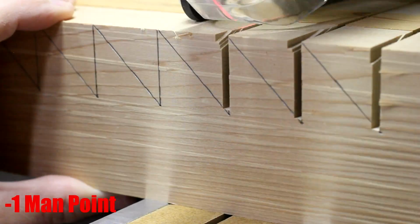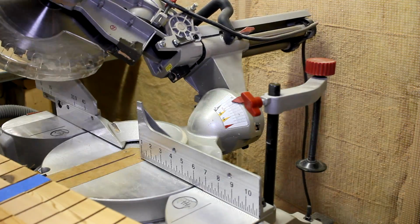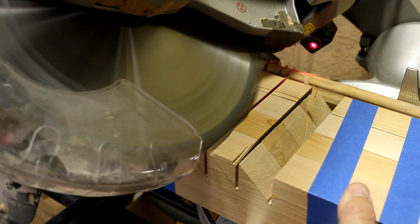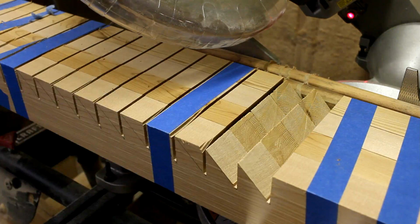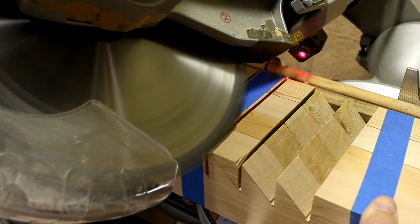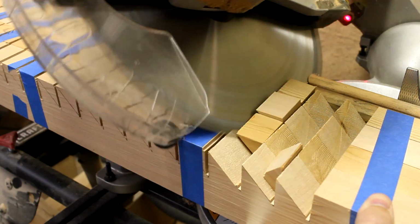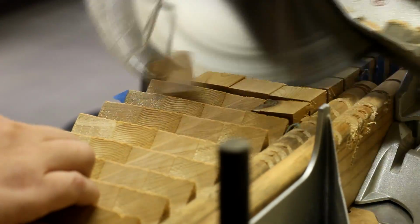It was pink. I then tipped the miter saw to the side and I locked it in for a 45-degree bevel cut. These cuts were a lot easier since I could line things up from the top. You may have noticed that I have 2 sacrificial boards behind the uprights. Those were just to hold the project pieces away from the fence so that the blade could reach its maximum depth throughout the full cut. Otherwise, since I'm using a depth stop, the cuts would come out curved, and that would be no bueno.